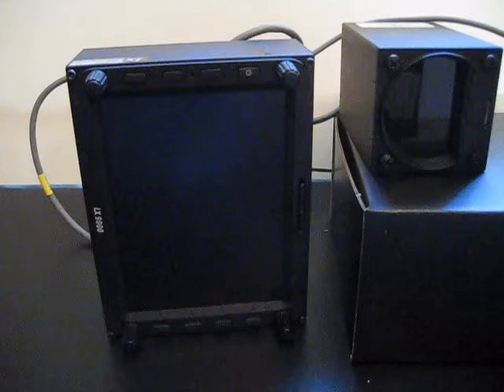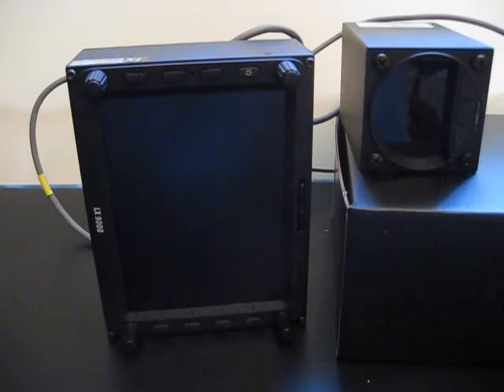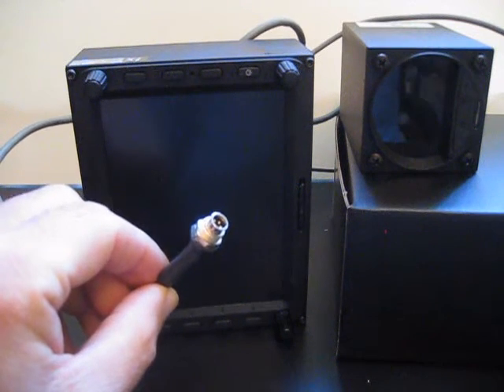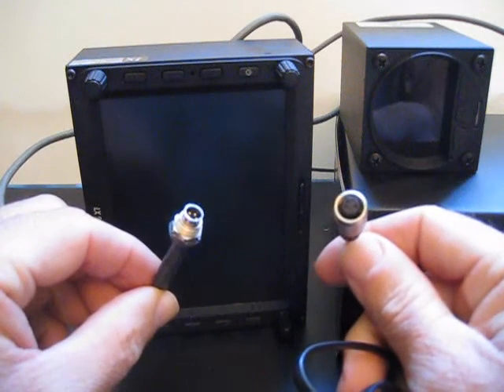In this case, we'll be connecting a Power Mouse, but we could just as easily connect a Power FLARM Core or a portable to the LX9000. To connect to the LX9000, what we need is this 5-pin Binder RS232, and we can get a special cable from LX that has the mating end for it.